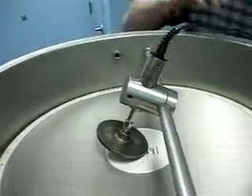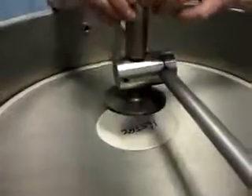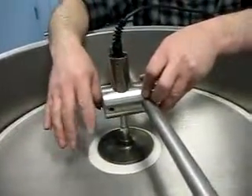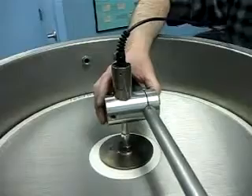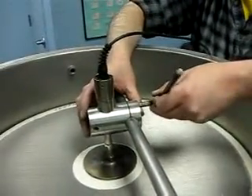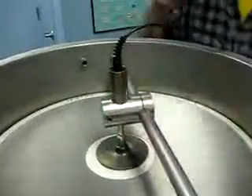Once the disc is snug, we loosen the back nuts that hold the holder and put it in place. We straighten that out, and you can see the transducer moves nice and easy in and out of the hole. We put the disc flat onto the epoxy mount pad, making sure it is parallel with the screen. Once that looks properly set, we tighten the holder to the support bar on the frame and snug that up.